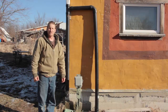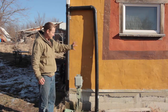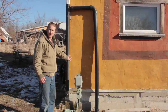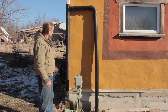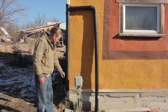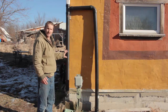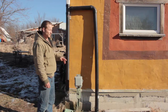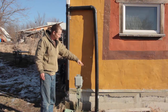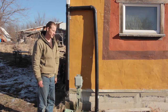The water comes down from the roof, and I've plumbed in this ABS piping so that I can have a tube to catch the first wash that comes off of the roof. As soon as it starts raining, this will fill up. Put the cap on and it'll catch all the sediment, all the leaves, and anything else that might be on the roof that I don't want going into the cistern. And then once that fills up, all the rest of the rainwater will go into this tube that's diverted into the cistern tank.